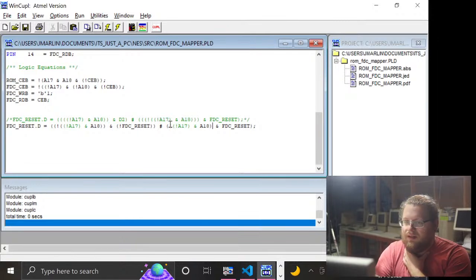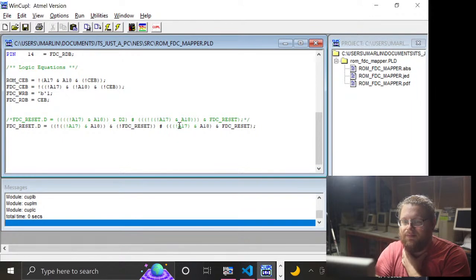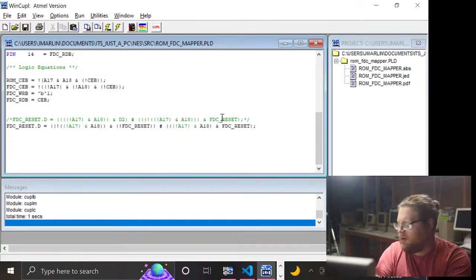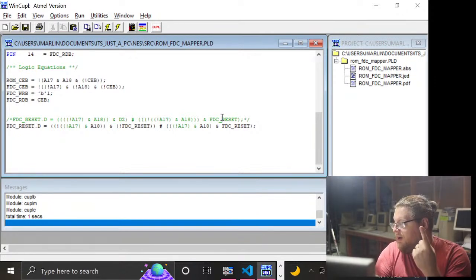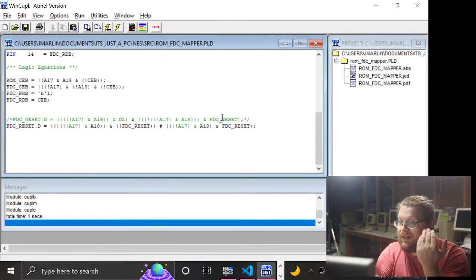But without looking at the signals, it doesn't prove it. Maybe there's still something stupid. I'm overthinking it. Let's just run this and we'll see what it does, because my gut feeling is it's probably not going to work. Sorry, I'm kind of talking to myself, because two things happen every time we press this key. One, we're doing the write to C1000 to flip and flop the value of this thing. And we're doing a read from the floppy controller. So we're accessing both areas.